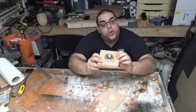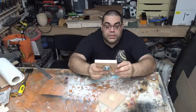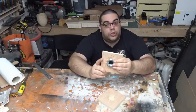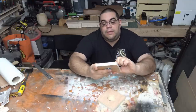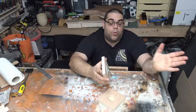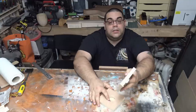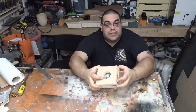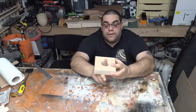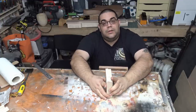So that's the nut glued on and the epoxy has been left to cure for about an hour — it's five-minute epoxy so it's not completely set, hopefully it will finish overnight, but it's certainly good enough for now. I've left it proud a little bit, because when it screws onto the lathe there's no need for the wood to go all the way up — it just gives a little bit of flexibility. This piece has got a hole in it so that when it sits on the back there's space for the thread on the headstock of the lathe to poke through. Now all I need to do is glue all these bits of wood together, clamp it up and leave it overnight.